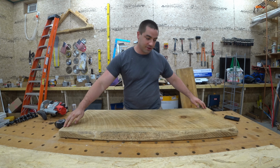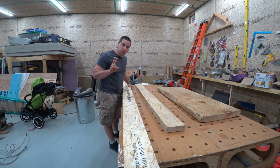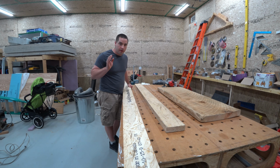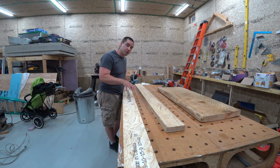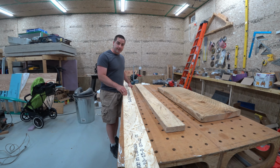As you can see, there's quite a bit of play. First thing you're going to need are 2 rails. Now these need to be very straight boards, and the straightness of them is going to determine how flat your end project winds up. So I'm actually using some LSL, or laminated strand lumber.